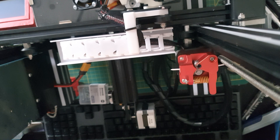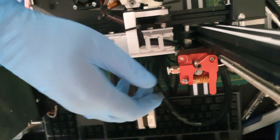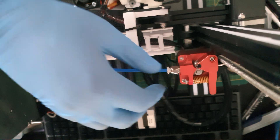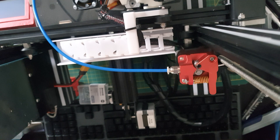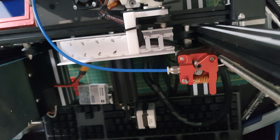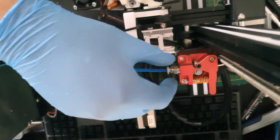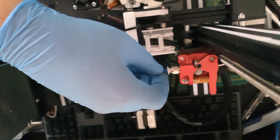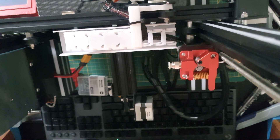So that means I would have my fitting there, the tubing installed with the clip to keep the pretension. What happens when you're printing is your filament also retracts, so it moves backward instead of forward, which causes a constant push-pull cycle. Eventually the teeth will wear out the plastic and just rip out your tubing under pressure, leaving filament all over the floor.